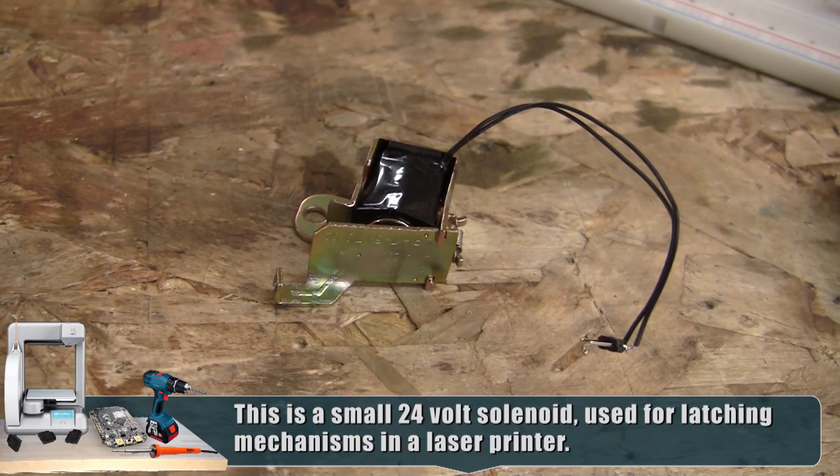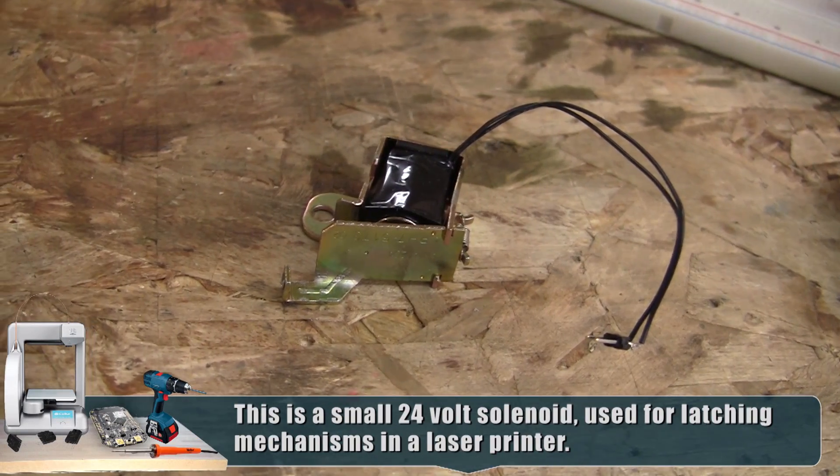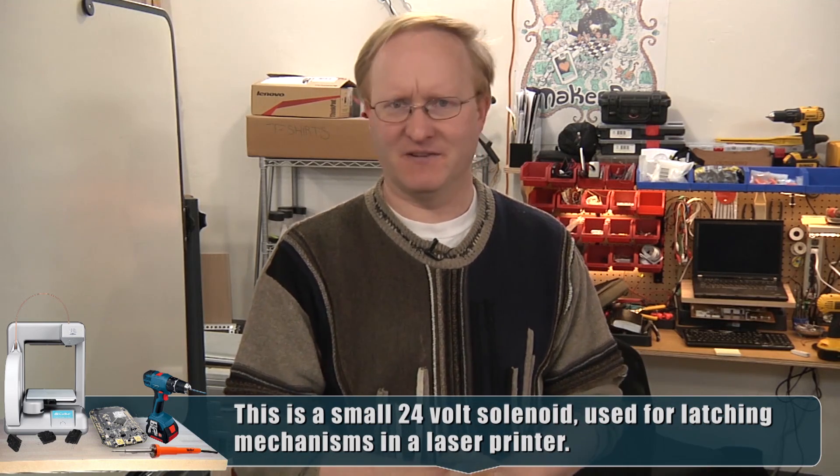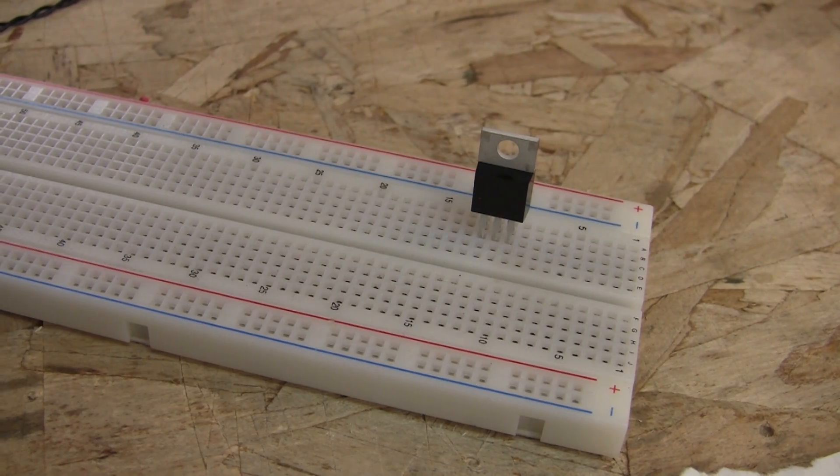While Felix works on the dog door I'm going to wire up another 555 one-shot or monostable multivibrator so that when the door gets the signal from the key fob it'll stay unlatched for about 10 seconds — that way the dog has plenty of time to get through. The solenoid we're using we actually pulled off of that laser printer from our Earth Day episode. It takes very little current, about 120 milliamps, so if it's on for 10 seconds that's not a big deal and we won't need any additional circuitry to control it. We'll just pass the signal through a TIP 102 NPN Darlington transistor.